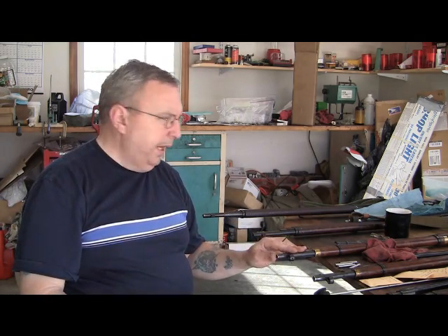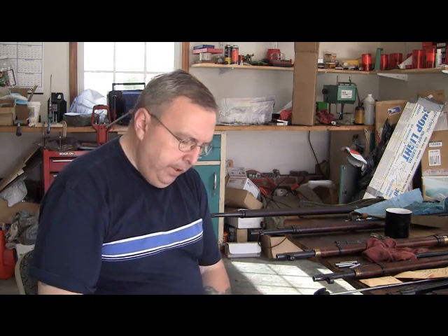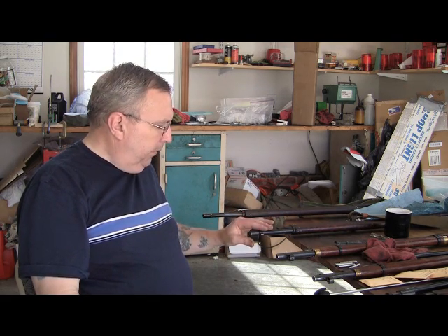I went and tested all these guns and measured them all. I didn't slug them all — I ran out of lead sinkers — but I measured the bore diameter on all the rifles. I found a couple old 91s, Finnish ones, a Westinghouse, and another older one. They seem to have a slight counterbore at the muzzle. The Westinghouse is a bit more worn — took a 302 pin, 303 wouldn't go. The old one took a 301 pin, 302 wouldn't, putting that bore at about 302.